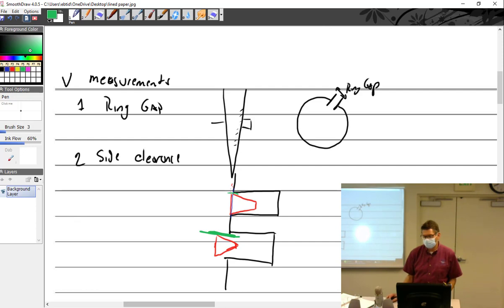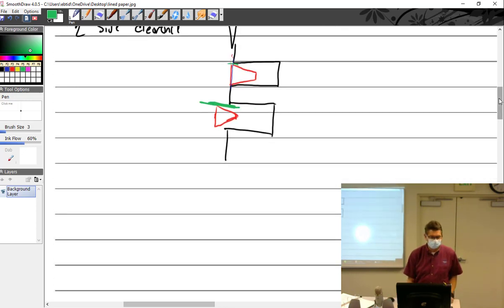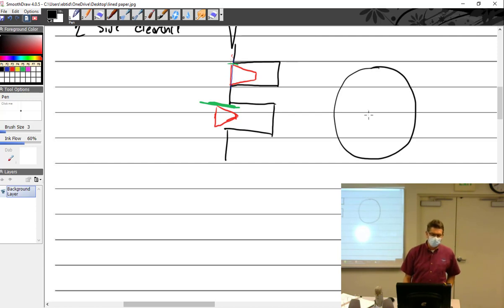All right. This one's kind of a funny one. So we'll talk about this. So right, when you put them on a piston, we'll let this be kind of the piston. And you have how many rings? Three. Okay, so we'll say that this is the way this sits in an engine. So this is the top of the piston, right? It's going to be different for you because you're building them in a vertical spot, but think about it sitting on the aircraft. You're not supposed to line up the gaps. So you have three rings, but you wouldn't want to put all the gaps lined up right there.